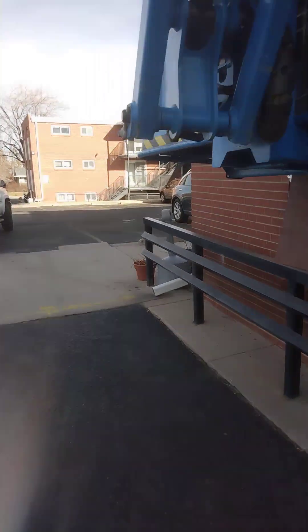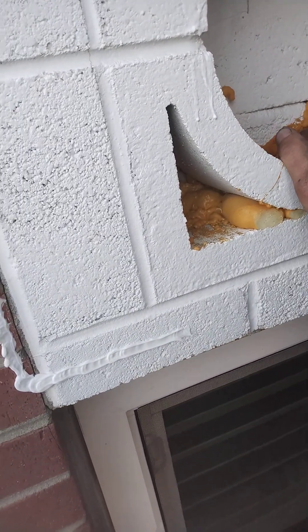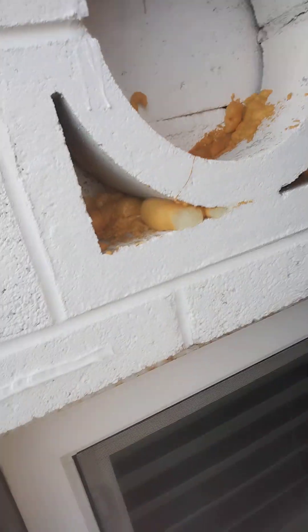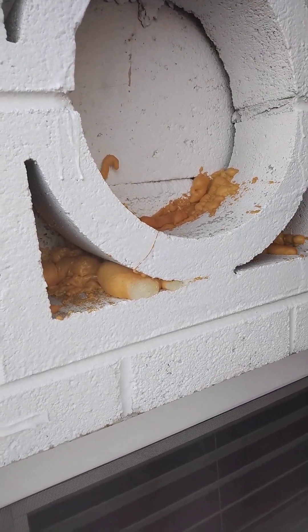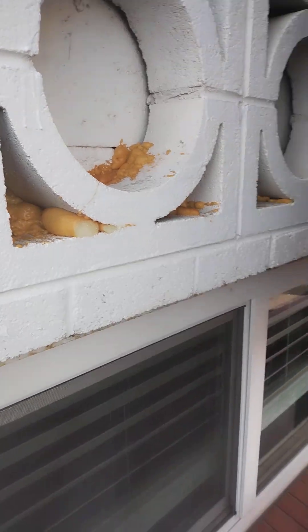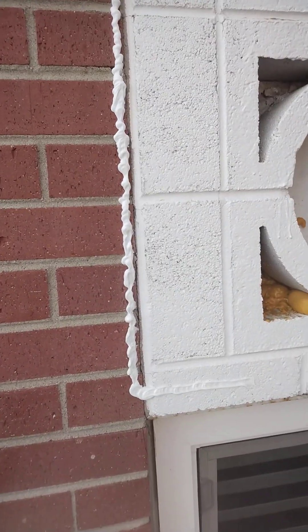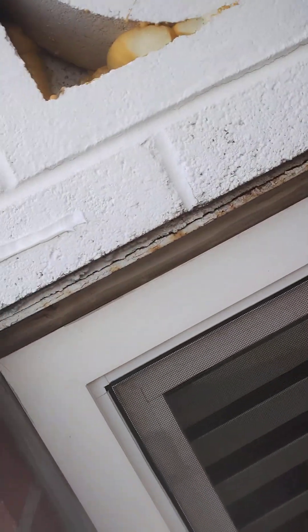This is the next gig - got all these white knockouts on two buildings. We had to come in before a rainstorm because all the rain was running behind the brown bricks and just dumping into the units. I dumped half a glass of water in there before I could fill the glass again - the lady inside was like 'stop, it's coming in.' So we're covering this whole mess with steel plates, taking them up under the brick ledge with silicone all around them. I'll let the steel hang down about two inches for a drip edge so it ain't blowing back up into the lintel.